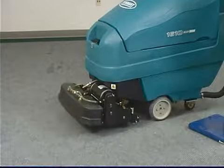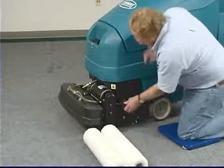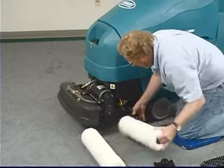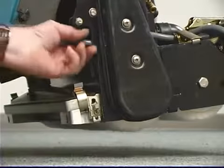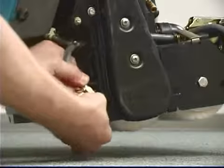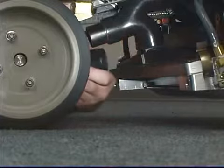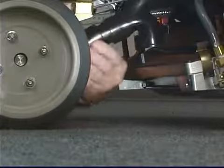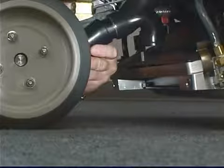To prepare the machine to use ready space, follow these four steps. Step one: unlatch both idler plates and install the two ready space rollers; either end may be next to the idler, and rollers will be rotated after each 10 hours of operation. Step two: install the rear ready space vacuum shoe on the scrub head and connect the solution flush lines. Step three: connect the vacuum tube to the roller vacuum shoe. Step four: connect the vacuum hose to the vacuum tube. Note: if carpets are heavily soiled, first use restorative extraction before beginning your ready space program.